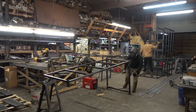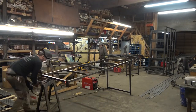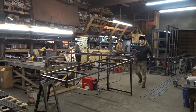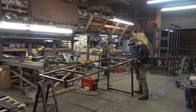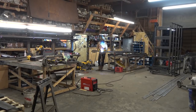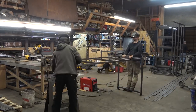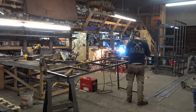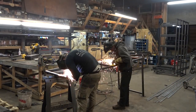He's working welding and grinding, I'm welding and grinding, Tommy's welding and grinding. We're filling in the tops of the shelves — all those welded connections — as well as picking up anything we missed along the way. When the assembly was on the jig it was face down, so these parts weren't accessible. We have the whole smorgasbord of welders set up; we're using three different HTP machines just to rock through them as fast as we can to get the 30 of these done. It took maybe an hour and a half.